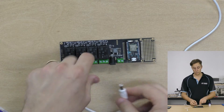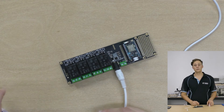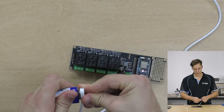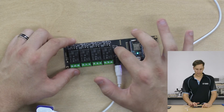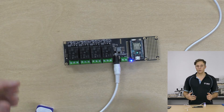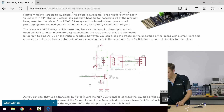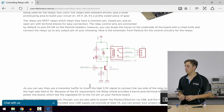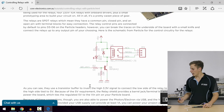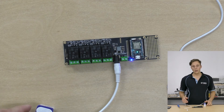I'm going to plug this in and get started. I haven't got anything on the prototyping section yet, although I'd like to make a fun project - perhaps connect it to a pool pump or a coffee machine with a temperature sensor, or a weather station with indicator LEDs. When we connect it up you'll see the blue light on the board for power. There's a regulator circuit which converts the 7 to 20 volts into a 5 volt supply which goes to the VIN pin on the Photon. The Photon then has an onboard regulator that regulates down to 3.3 volts, and that signal gets fed to the control circuitry. The control signal goes through a transistor buffer which switches a 5 volt supply with an indicator LED and a flyback diode to protect from EMF on the coil surges.